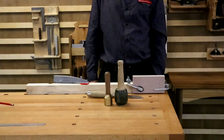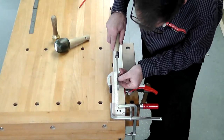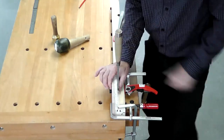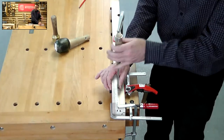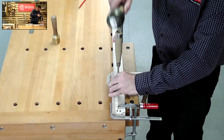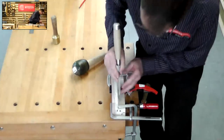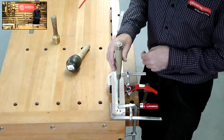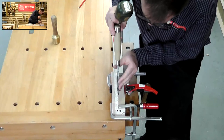Ben and Steph are now looking more worried because they suddenly realized I'm going to make some noise. First thing — I want to set that line right down the bottom where I've got that pencil line, just inside it, coming up. I want to create a groove. I can use my Corian block to help support it. Just inside my line — fingertips, square things up — create a tap. The back of the chisel at the moment is facing that line. I want to come up to the other end, turn the chisel around, line it up with my line, create a tap.